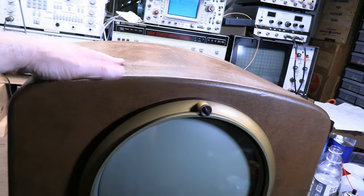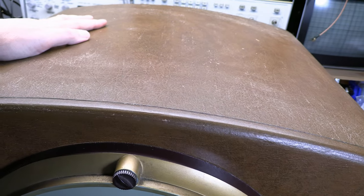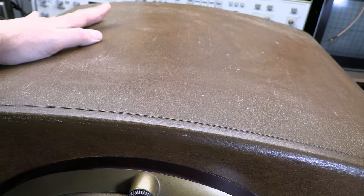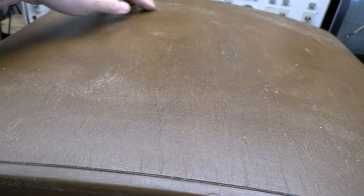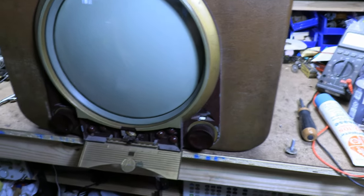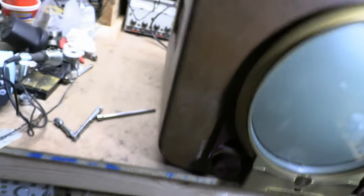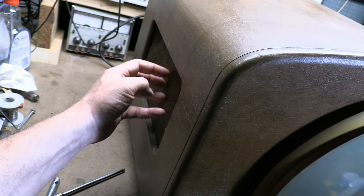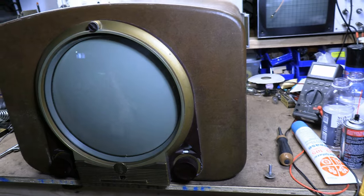As far as the cabinet itself, it's some kind of Tolex covering. I'll clean it up a little bit, wipe on a little Walnut Howard's Restore finish to get some color back where the finish has flaked off, and rub the whole thing down with some Oz furniture polish. There's some paint that's flaked off here and there, a scuff here and there, and the grill cloth — which is actually kind of plastic — has deformed a little bit. I won't tear it apart and recover it in Tolex.